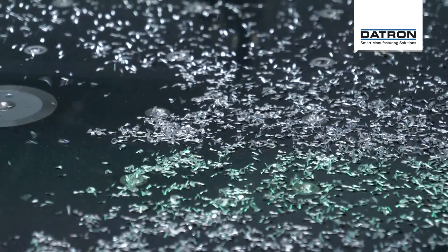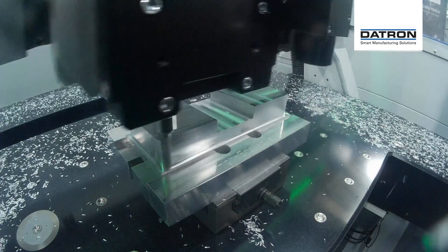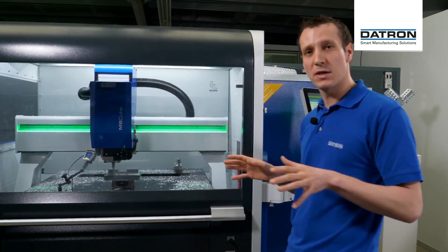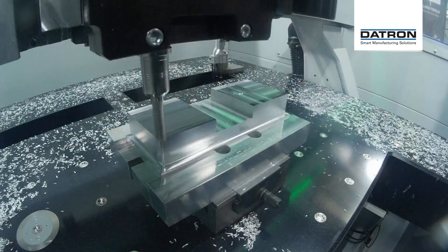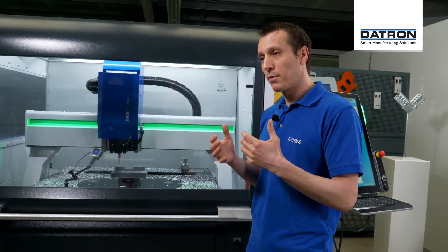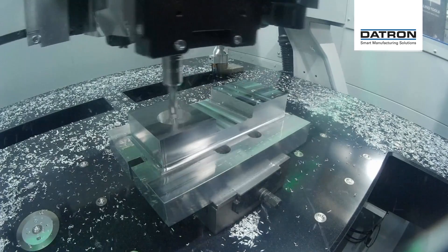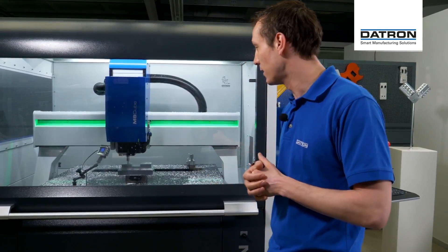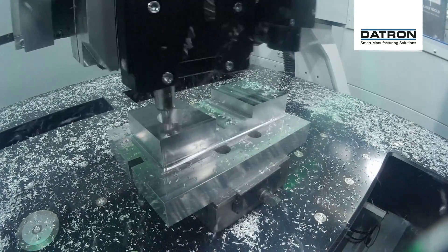The chips this tool makes are extremely short despite the dynamic strategy at full depth. This brings us to chip volume and process stability. If you've ever used dynamic strategies like this, you've probably faced the problem of very long chips piling up into big blocks that get stuck in the machine and interrupt the milling process. That was another reason for the development of these tools. We have a nice comparison of chip volume — cross cutter versus straight end mill — to show after the milling operation.